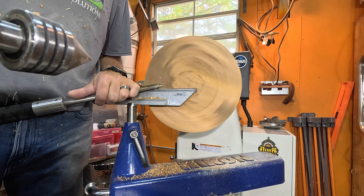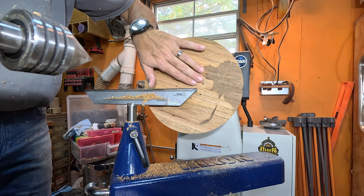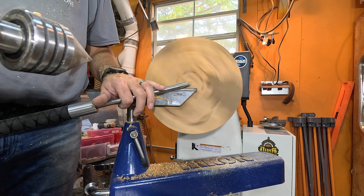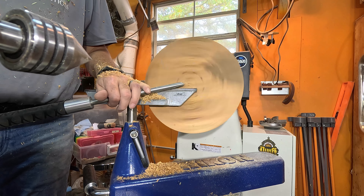We're going to start with our mortise in here, going to the left with our mortise in the middle portion. We're going to start flattening off this surface. Now that ticking you hear as it turns is because it's not leveled off — you can see there's low spots and spots that I have cut. That's the sound of the tool not hitting the wood continuously. We just want to keep going till we get that smoothed out, and then we will start getting our mortise area done.